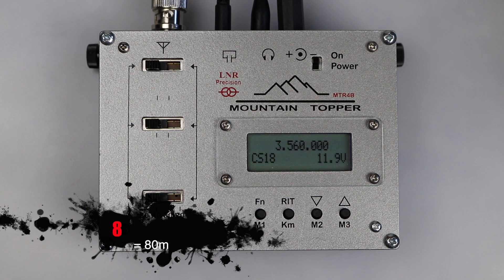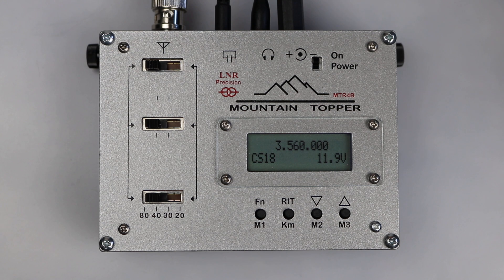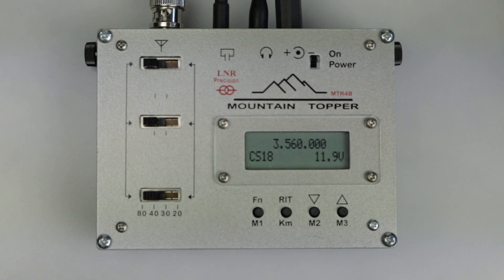Firing up the radio, you can hear the current band selection enunciated in CW. You can also set up the radio to enunciate the current frequency when the function button is tapped. The MTR-4B can operate from about 6 volts up to 12 volts. Note the advisory on using no more than 12 volts, and be aware that some batteries can provide greater than the stated voltage when fully charged. For example, my three-cell LiPos are marked as 11.1 volts but when freshly charged the output can be as high as 12.5 volts. You can use a small DC-to-DC converter or insert a diode or several diodes in series into the power feed to drop a small amount of voltage. The radio does display the supply voltage, but LNR state this can be as much as plus or minus 0.3 volts out, so if in doubt check with a voltmeter.